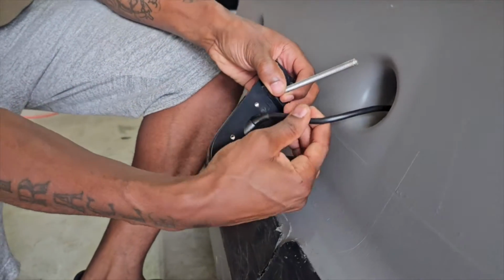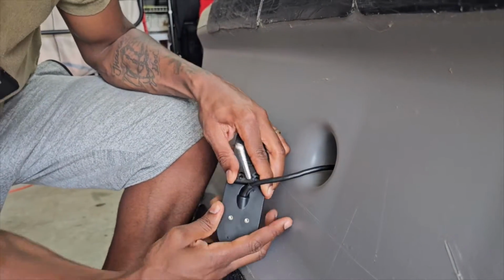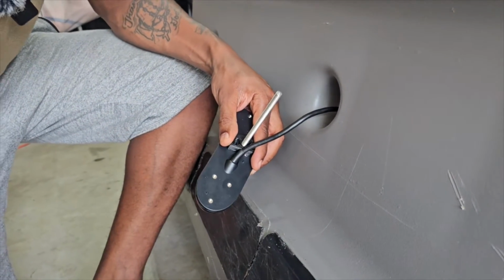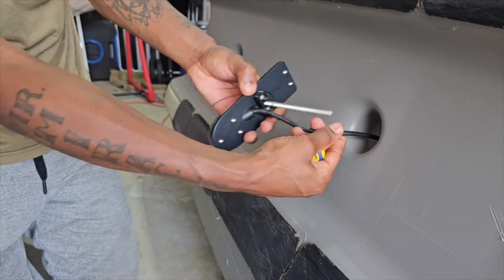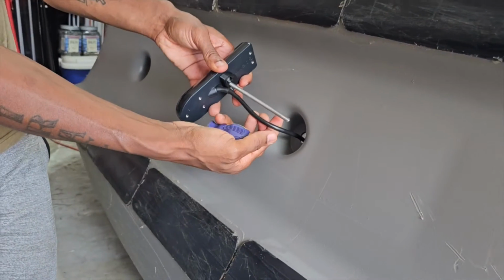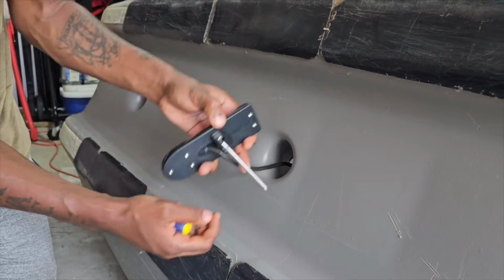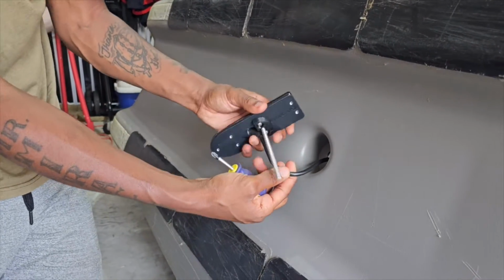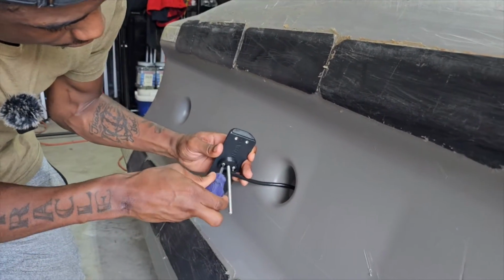Look, you put it on here. See those 2 screws? Those are the only 2 I'm concerned about. Right there, put it right up, and your transducer is gonna go straight up like this. You're just gonna mount your screws into it. So I'm gonna try to get a screw in really quick on camera for you guys so you can see it, why I like it. All right, guys, so all I did was I just put the screws in, and I would say, since I ran my wire already, it's a little bit more difficult to do at this angle. Before you run your wire, put the transducer piece on, so you don't have to like bend it back and have it at this kind of awkward angle. I was able to just hold it in my hand and do it when the wire wasn't already through. So do that before. So I'm just gonna finish tightening down the screws, get them really snug in there.